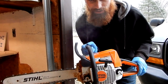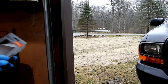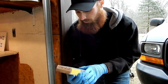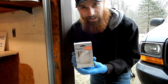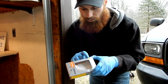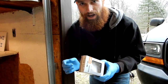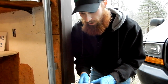Also another tip for the commercial guys out there: buy these chains. It's a 26RS-68 for the MS-250 — I want to say it's for the 18-inch bar, but it's non-kickback, so it takes out bigger chunks. It's got this little yellow tag right here. I want to say it's like a buck or two more, but it carves through logs. I'll do a demo on the regular chains, the non-kickback and the kickback chains, in a couple videos from now.